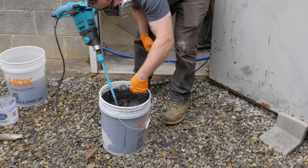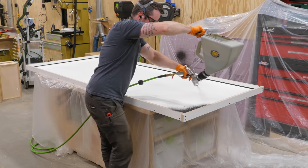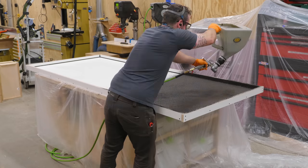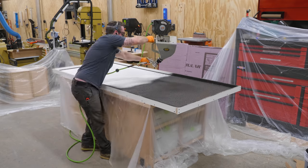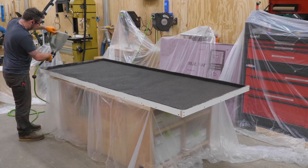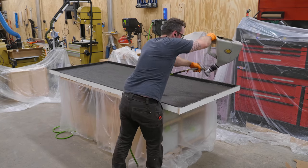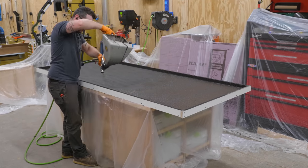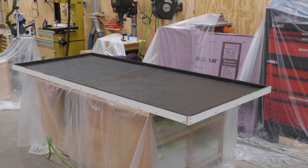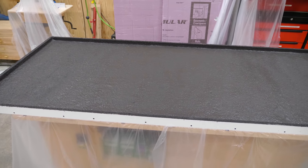To solve the thick mix, I could have added some plasticizer, which helps the concrete flow out without adding more water. Once I had the face coat mixed up, I got some of it loaded into the hopper gun and started spraying it into the form, immediately realizing I hadn't put down nearly enough plastic. When spraying GFRC into a form you want to work backwards, overlapping your previous strokes and covering the entire surface with roughly an eighth to a quarter of an inch of material — working backwards helps keep air and sand from getting trapped in the final surface. After spraying, I came back with a chip brush to smooth everything out and help make sure there weren't any trapped air bubbles. Since my mix was so thick I hadn't gotten the coverage I was looking for, so I added some plasticizer and added another coat. It was also at this point that I realized I had forgotten to adjust the PSI on my compressor — I was blasting the mix through at about 100 PSI when it should have been closer to 25 PSI. Eventually I got the second coat added and repeated the chip brushing process.